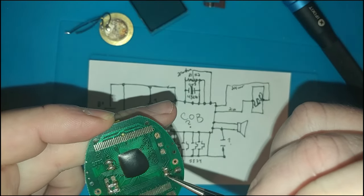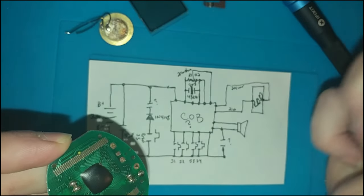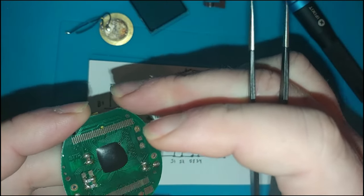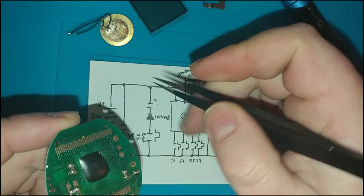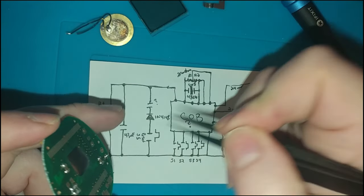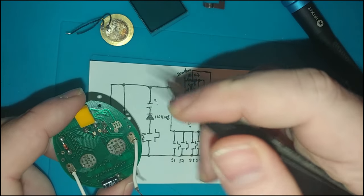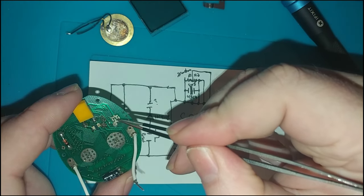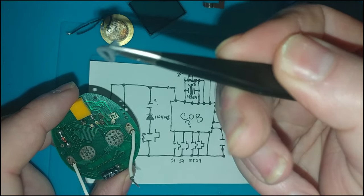I think it was this one right here I was looking at. Yeah, it's that one. I didn't take a capacitive measurement of it because I didn't want to remove it off the board, etc. But from there, you hit a 1N4148 diode going to a switch. We'll call this switch S5, which was populated here on the back of the PCB. That was the reset switch.